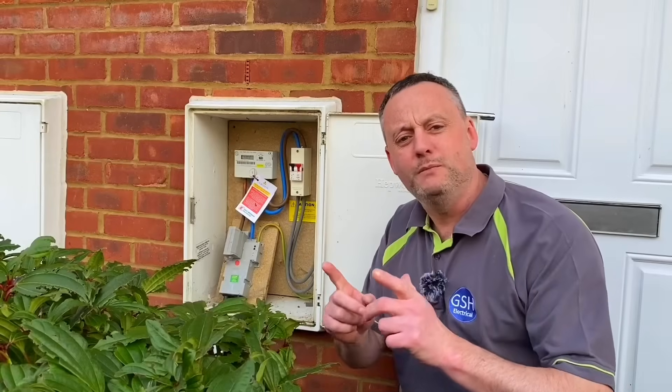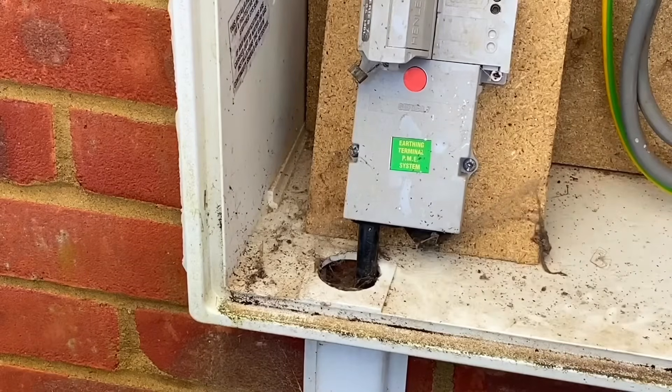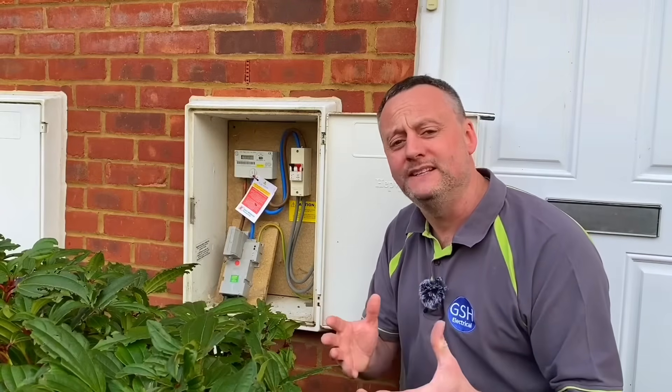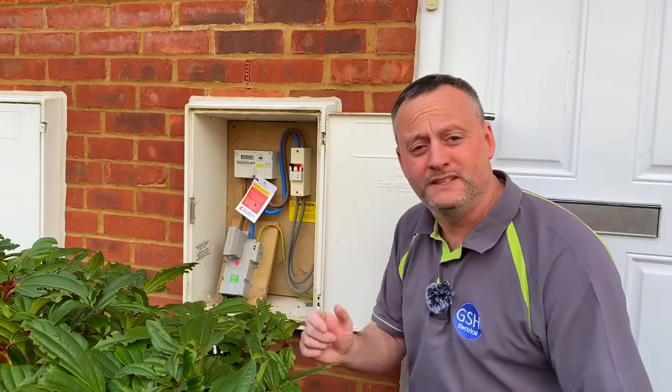In this video presentation we're going to look at the cable that comes into the bottom of the cutout. It's the black cable down here, often confused to be a steel wire armoured cable. However, we're going to see that it isn't — it's actually a concentric cable. We're also going to cut back to the classroom where I can show you how it would be connected within the cutout itself.